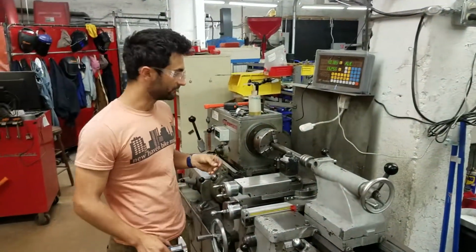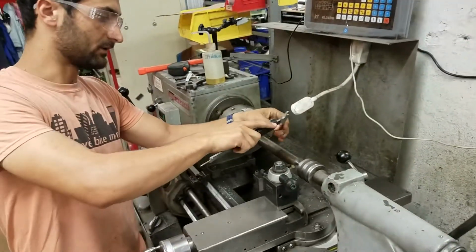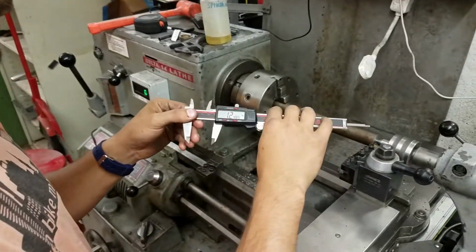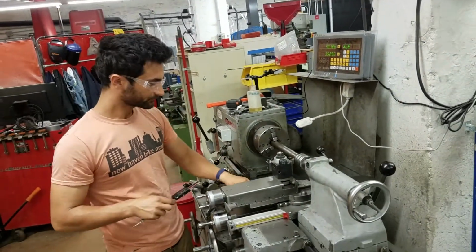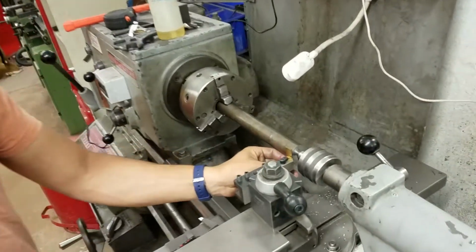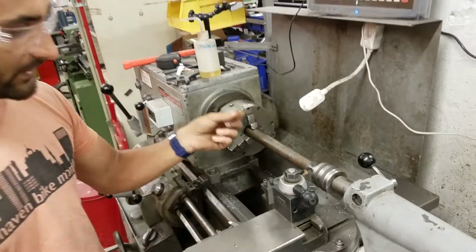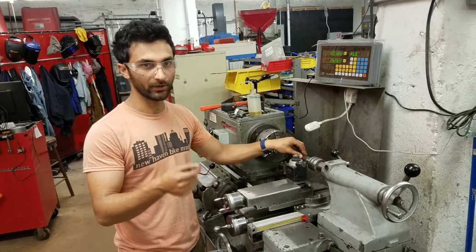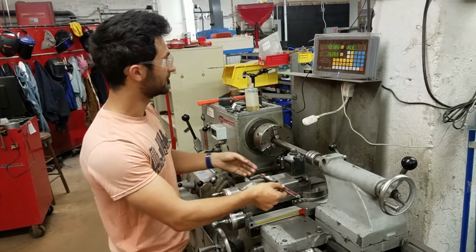As soon as we hit the middle, then we zero the X. Then another way of setting the zero is by taking a pair of calipers and measuring it. So here we'll measure what we have, and this says it's 1.2485 inches. So for the sake of this, we'll call it 1.25. And then here we have our piece of shim stock. So we'll touch off of this, and then it's just biting just there. So we know that this is 0.01 inches thick. We only talk in diameters here, so this is actually 0.02, and then we'll add 0.02 to this, so that's 1.27, and so that's what we'll tell this.